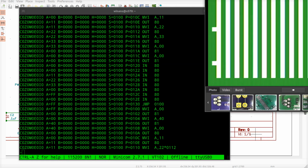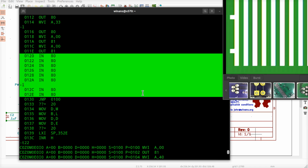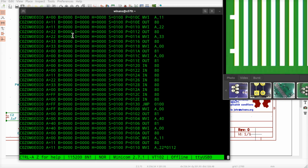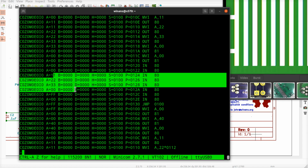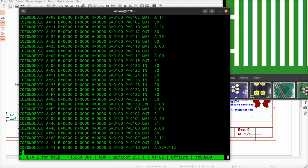All right, so we wrote into the DRAM, and then we went around even further. I miscounted, I guess. Anyway, we wrote out and read back in, and you can see the 112233 came back. Oh, that does suggest both DRAMs are working, because last time it was just 00010203. So this strongly suggests that both DRAMs are working, at least for a couple of bytes worth of data. So this is a very positive test.